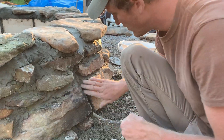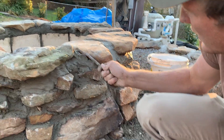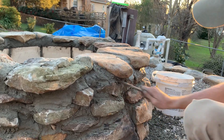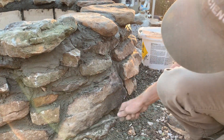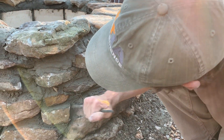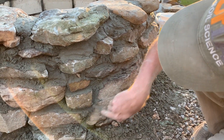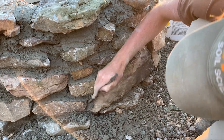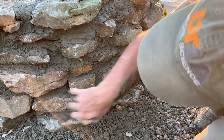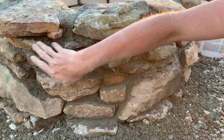Last step — we're going through while the mortar is soft and just doing a little touch-up, scraping all the excess out. We go about half an inch into the mortar so that the rocks start to pop out. When you take enough mortar out it really makes the whole thing pop. You can use a stick, a wire brush, or anything like that. Whoa, look at that thing, Ashton — we killed it, man. Look at that beautifulness!